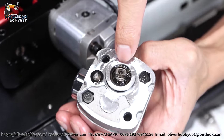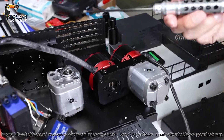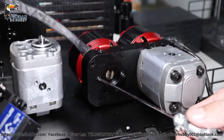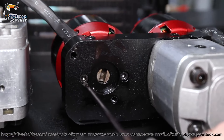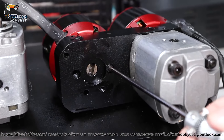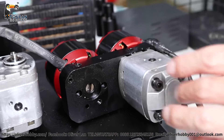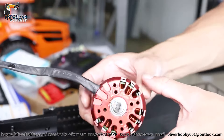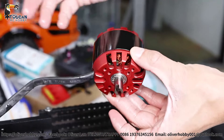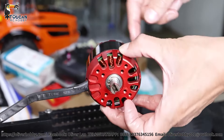All these wires were connecting here via quick connection — unlock and push down. The bottom is already connecting to the two pump ESCs. Note the sequence and take photos of which wire goes to the forward pump and which to the rear pump. Before removing this pump assembly, there are three screws securing this black part for the middle connection of the pump and motor. Remove those three short screws, then the pump assembly can be lifted directly up since the four screws are already removed.